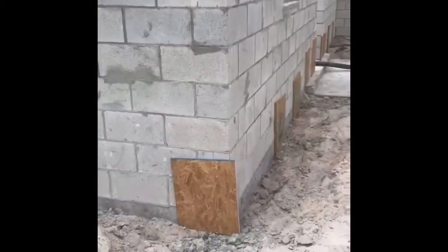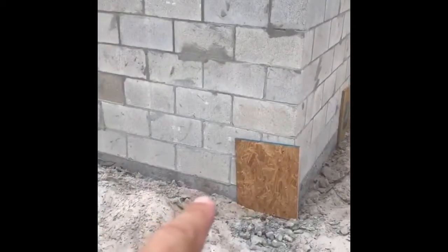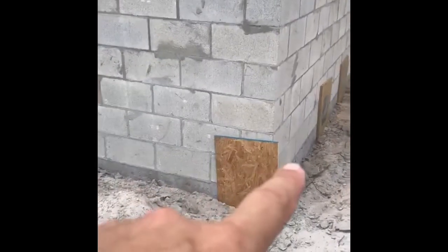The purpose is to make this monolithic slab from the footing, railing around with rebar, up vertically in those 40 spots around the home approximately. They'll go straight up to the top. Up there in the next portion of this video, you'll see that there's rebar all around the perimeter tied in to those rebars that go from top to bottom. And along the top, you'll see screens that'll stop the flow so the concrete doesn't come down every single cell, but only those designated ones.